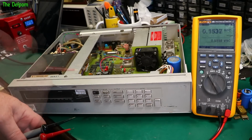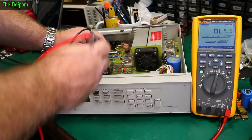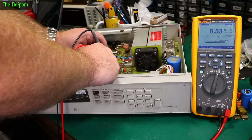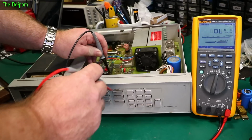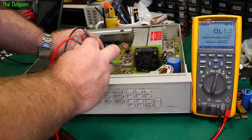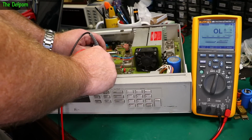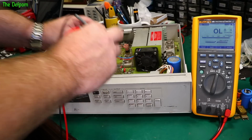That's interesting. So what I'll do now, I've got power turned off. So I'm going from that 0 volt reference again, or the S reference, onto these fuses. So I get 0.5 ohms that side, and this one. So 0.5 ohms, right? So that's the secondary winding going to those fuses, right? So what I was actually trying to test for was a short, to see if there's a short on the outputs of these fuses, and there was nothing. Right, both fuses, there's no shorted outputs.